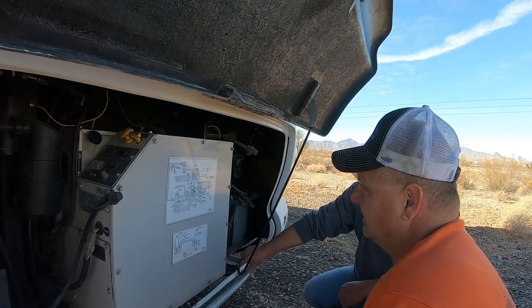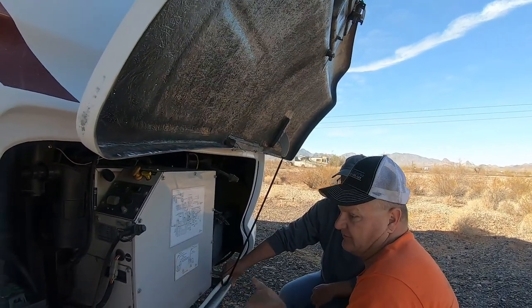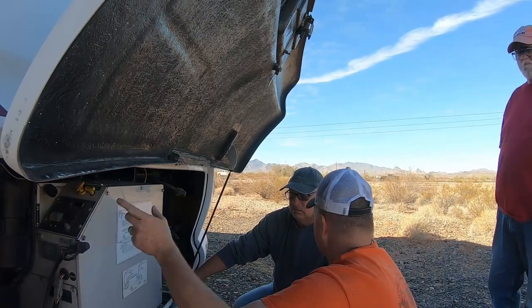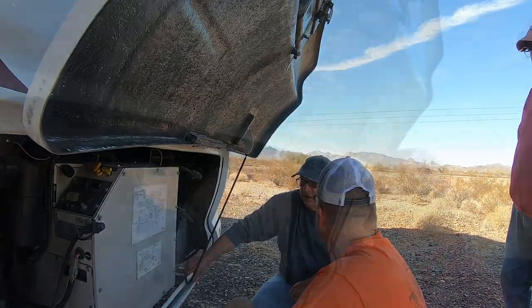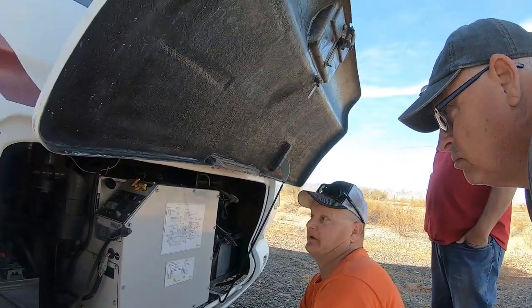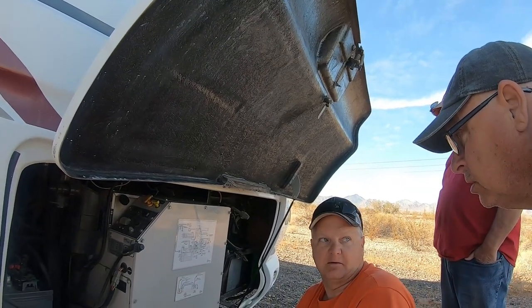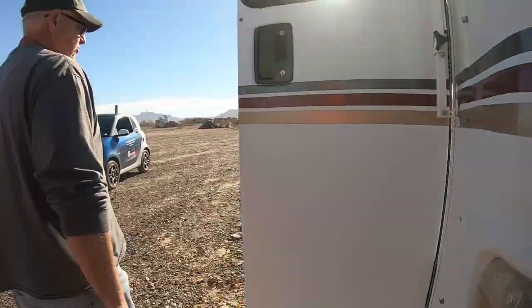Okay. All right, yeah, so if you install everything in that bay the way you want it, then we can wire it from there. We're going to have to run a wire down underneath the coach and back up to that Pathfinder, because we might as well just let it live where it's at. First of all, we got to figure out if the whole coach is inverted now. If it's not, then we have to run a wire from your main breaker panel to the new inverter. Where's the main breaker panel?